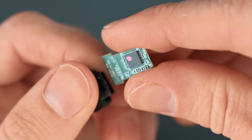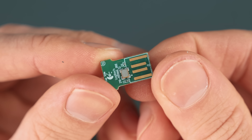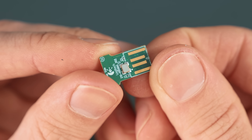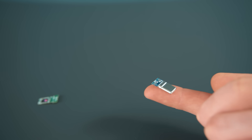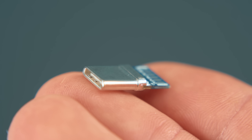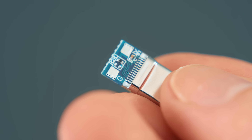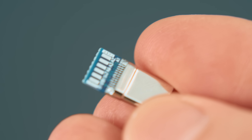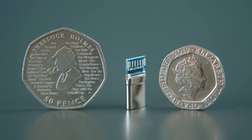Now that we're in, you can see that the PCB is very small, and has four copper traces on it. These copper traces fit into a USB Type-A port to make electrical contact, so from this diagram we can work out which ones do what. The outer two are for power and the inner two are for data. We now need a USB-C breakout board. This is basically just a USB-C connector that's been soldered onto a small PCB, allowing us to jack into its internal pins. It's absolutely tiny and inexpensive, and you can find links to them in this video's description.